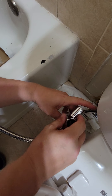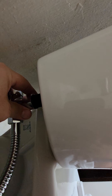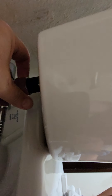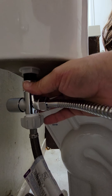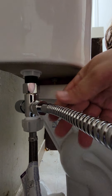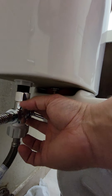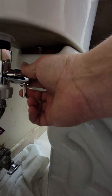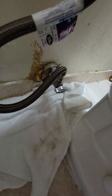This part right here goes directly to the toilet right in here — I'm going to connect it just like that. I'm trying to line it up nicely, then tighten this up, and I'll use a tool to tighten it as well. Now I want to align the T-valve so I can easily control the pressure — just like that, you can manually adjust the pressure — and then I'll turn on the water from right there.